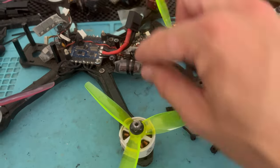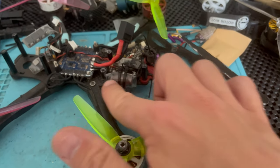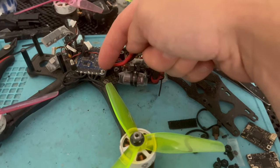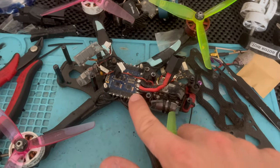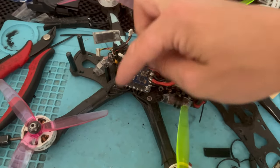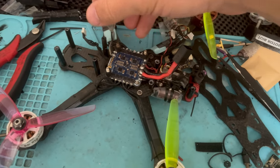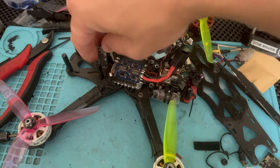We've got it installed. Two zip ties keeps it nice and tight. Also, sometimes these break, so always have a redundant one so it's not dangling during a crash and won't get chopped. I have it routing around the standoff and then it goes to the positive and negative pads. If your ESC doesn't have these pads, you would just attach it to the tops of the XT60. I have pads on each corner, so this goes directly to the front pad since I tuck it behind the camera. It's very simple — same thing: motor wires, a little heat, shrink tubing, and it just sits like this, vertical.